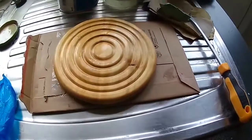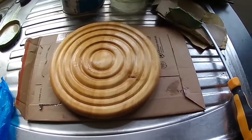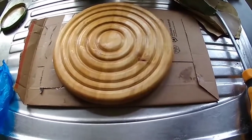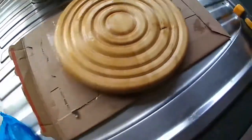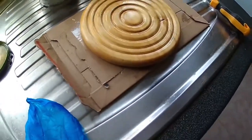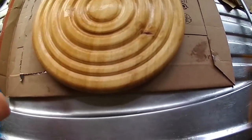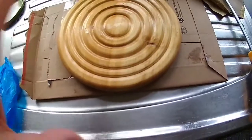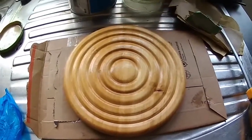I'm going to put it in a warm room now. I'll probably get two, maybe three coats of yacht varnish. It's not too bad at all. Obviously when you put varnish onto the wood it swells up and brings the grain up, so this will be sanded down yet again. But yeah, it's coming along nicely.